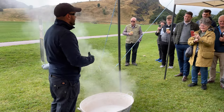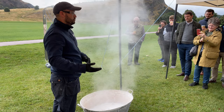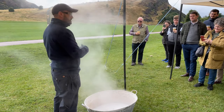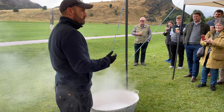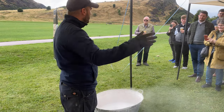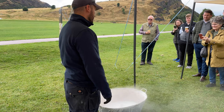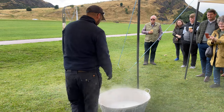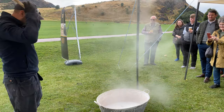Because I've added quite a lot of water to this, I've broken it down into a putty. Mix it with sand, dash your wall, plaster your wall, point your wall, build your wall — all from a piece of stone that you set on fire and added water to. And then a builder's merchant charges you a fortune for it. This is the slaking process.